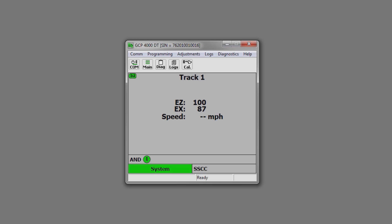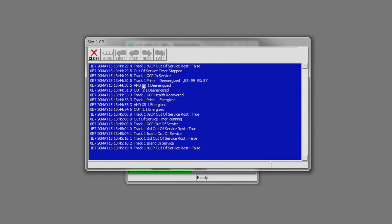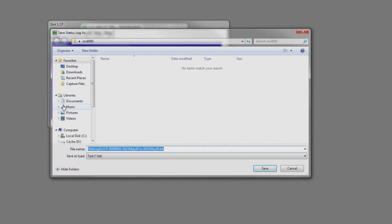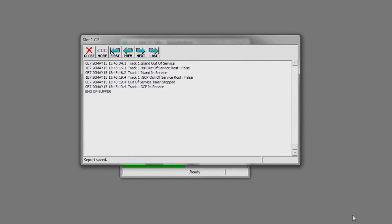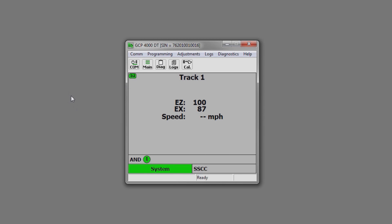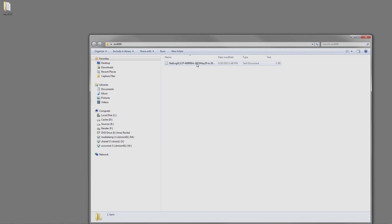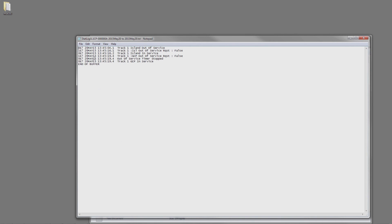Another feature of the unit is the status logs. The status logs are logs of the internal decision making of the unit. To get to them, you would just click on Logs, then click Status Log. More, more, and save. Save in a text format. Download by date — using the slide bar, you can pick the date that you want to download from. Pick your date, click OK. You need to have a place where you're going to save the log, and click Save. Now that you have saved the status log, let's go and verify the folder that we put it in, just to make sure that everything's there. There it is — let's open it up. And there's our status log.